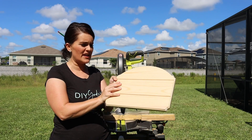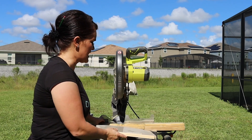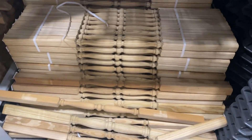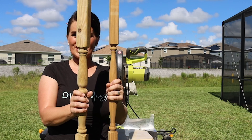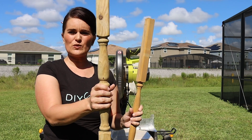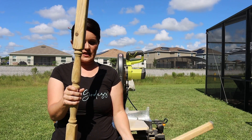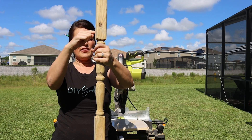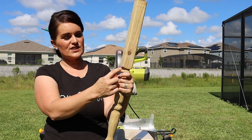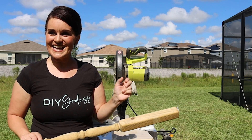Next up, we are gonna be making a recipe book stand. We are gonna be using some unconventional items for this and we're also gonna get a little bit powerful — so meet me outside. This is what I found at Hobby Lobby and we want it to sit kind of on an angle. For the base, I decided to use a deck spindle that I picked up from Lowe's. Here are the two different sizes I use most frequently — this one's a little bit smaller and skinnier, and this one's a little bit beefier. This is the one we're gonna go with. We are gonna cut it off right here, and up here we're gonna put it on at a 37 and a half degree angle. So we will make those two cuts and it will be super easy.